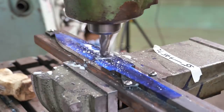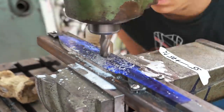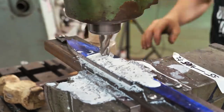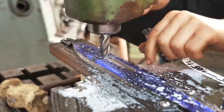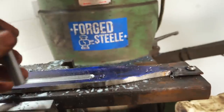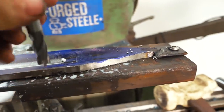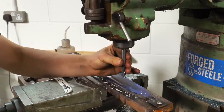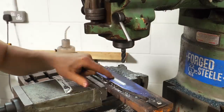If the high-speed steel ball end mill can't cut the Damascus, we'd have to go to a carbide end mill, but I don't have any carbide ball end mills — which would be sad, because then we wouldn't get a nice scalloped fuller line and we'd end up with straight sides. Hopefully it works and hopefully I don't snap it. It's going well — this is awesome, could have been a lot worse. We're going to use this 10-millimeter carbide end mill to go right in on that scribe line and make a 15-millimeter-long groove, 10 millimeters wide, so that by the time we grind down the rest of the blade it should match the width of the fuller.